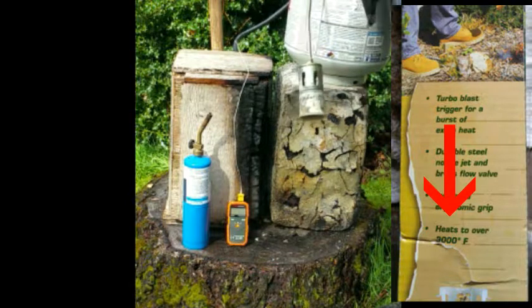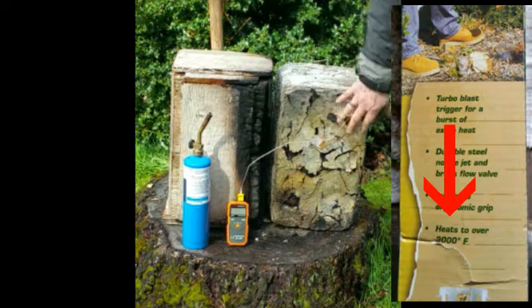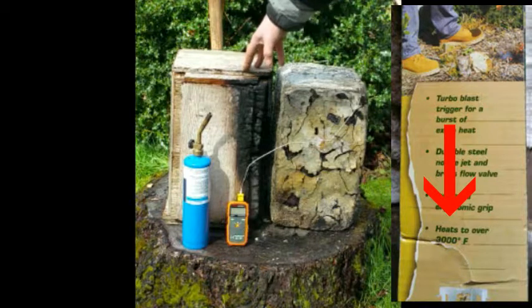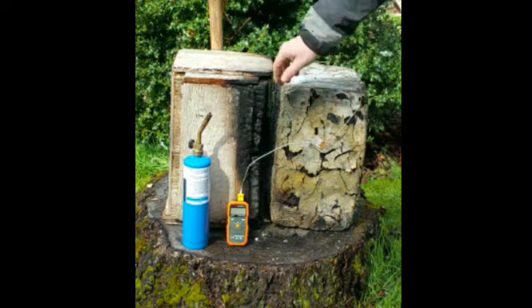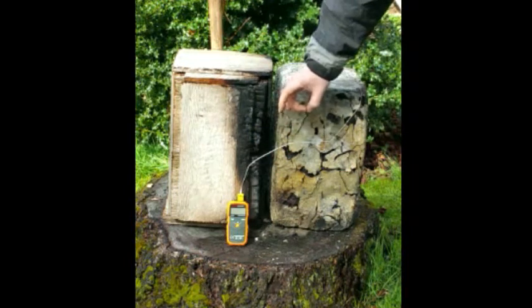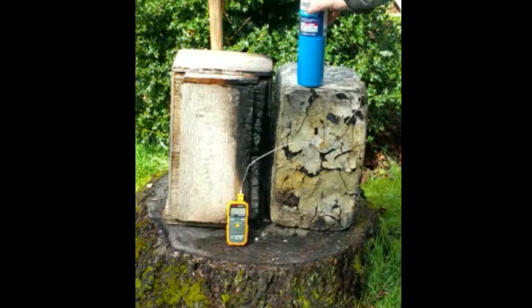And I've worked with glass in kilns, and normally when something gets up to 2,000 to 3,000 degrees, it'll glow. And if you remember, the composite block was actually glowing, and we subjected it to about 2.5 hours, a little bit more, to a full-on engagement of that torch. The box only lasted about 5-10 minutes and sustained this damage. Now I do have video of the same composite material being subjected to a little bit smaller unit, and it also glowed, probably in a spot about that big, size of about a silver dollar. My point is, when you get this material glowing, it's between 2,000 to 3,000 degrees.